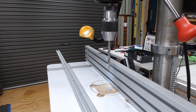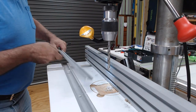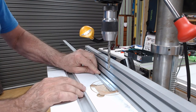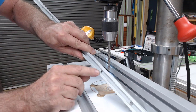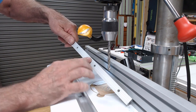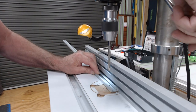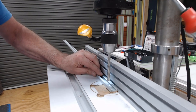All right. Now this is going to create, see, here I am, eye muffs. It's very important first of all, so that it's nice and clear, there's no obstructions, because we're working from above. This is going to create the countersink, and it's also going to get rid of that burr. See the burrs that are sticking up? That's why we've drilled from this nice and clean on the bottom. I haven't got to sand off at all. I've got the drill set to around 300 or 400 RPM, maybe a bit faster. And down we come. Again, I'm going to let it find it. Done.